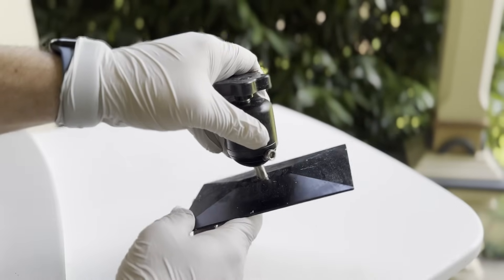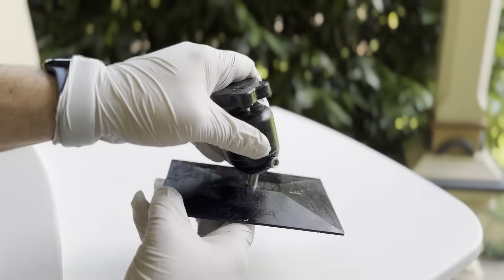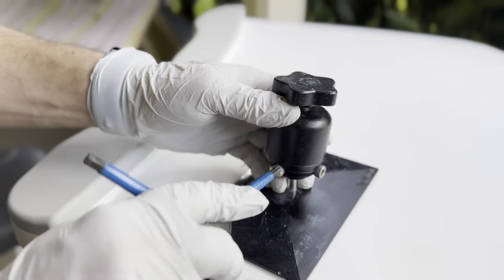Here's the older Mars 4 plate. To adjust the printer, you have to adjust these two bolts. The problem is that when you loosen them, the bed can move on two axes — it can go this way and it can go that way. It's really hard to keep the build plate flat, because when you hold down the plate to tighten the screws, you end up inevitably pushing on one side more than the other. I had a lot of prints on the Mars 4 that had perfect prints on one side of the bed and no print on the other side.